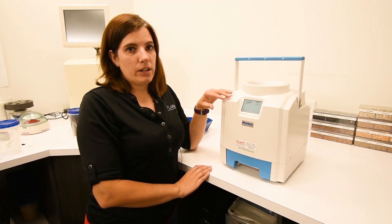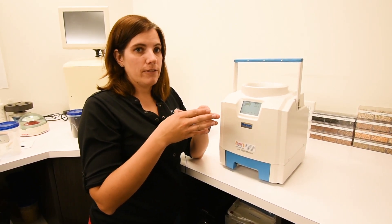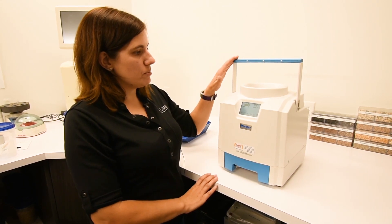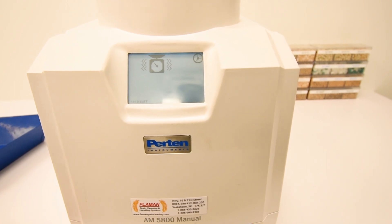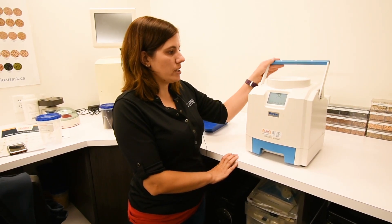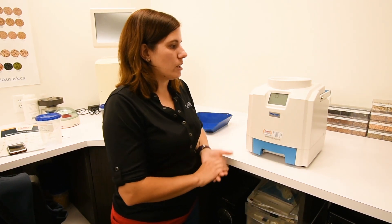It is alright to get the rabbit — too fast. If you get the check mark or the rabbit, you're good. You just want to make sure it's going to fill the cell inside fully. Once we have it in position two, we put it back to position one. You'll notice the backlight turns on and off — that's to conserve battery power. Now it's telling us to put the handle to position three, which strikes off the top of the grain, empties the cell, and back to position one so it can weigh.